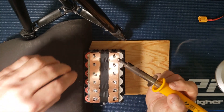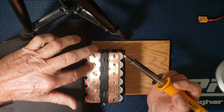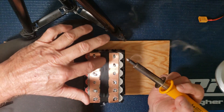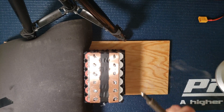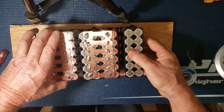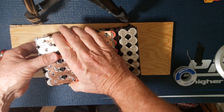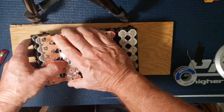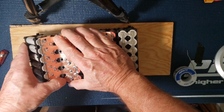I'll come back and hit all these sections along the outside, in between the cells, and then in between the cells on the inside. Basically, you've got four plates that make this 5P block, and what you're doing is making four of these 5P blocks — and that's your battery.